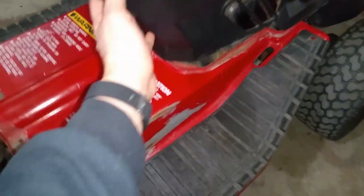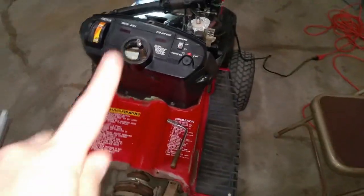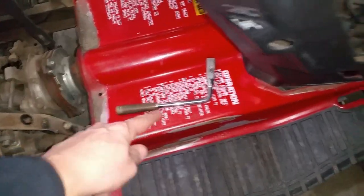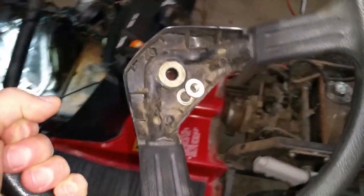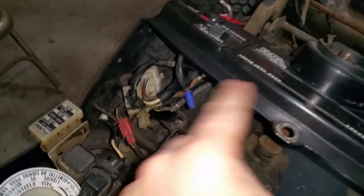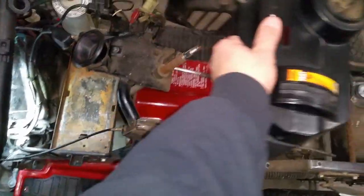Now you're going to have to remove this shroud. There are a bunch of shoulder bolts that are Phillips heads — one, two, three, four, and then five and six on the other corner. There's also a hidden one once you remove the steering wheel. You will also need to remove the 12mm bolt that holds the PTO arm, located right here. To remove the steering wheel, it's a 17mm bolt — I would suggest using an impact on it. It is keyed so it will pop right off. Finally, disconnect all the Molex connectors running up to the console — I believe there are three. Once you do that, the entire assembly should come completely out, which exposes the foot plate so you can remove it.